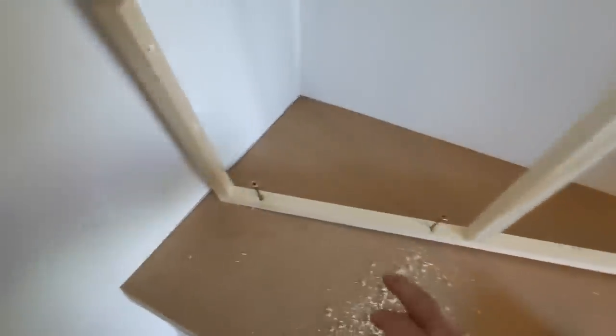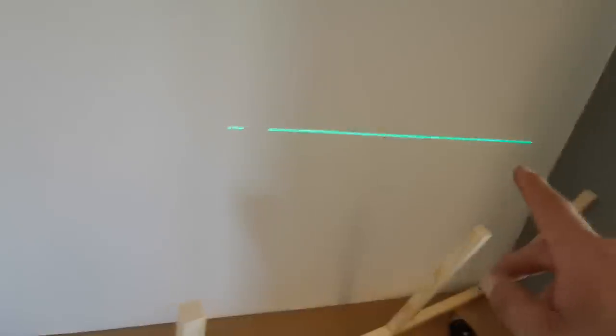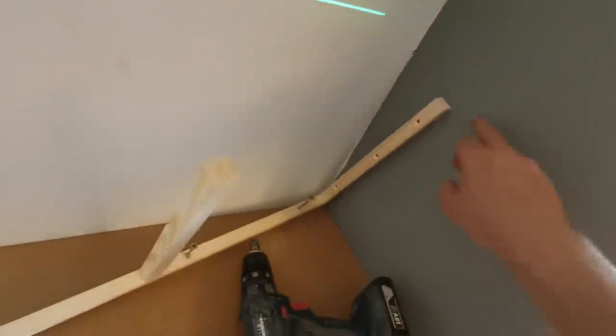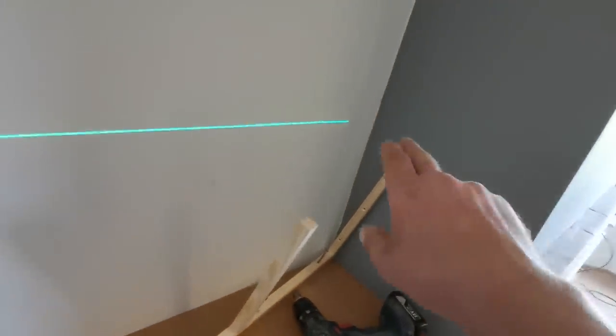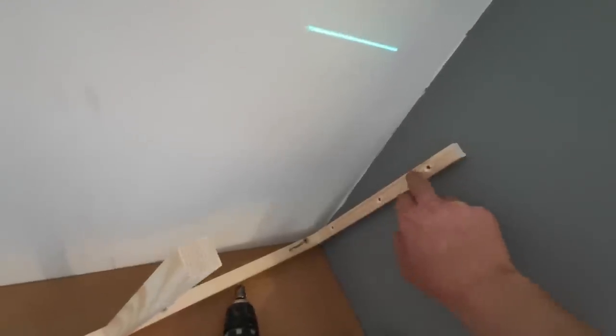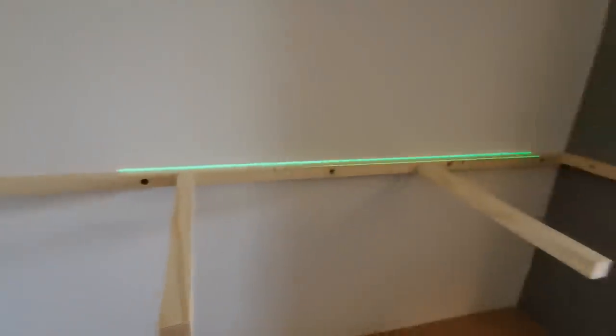So I've drilled it just like I did at the pattern below. I'll hold it up to my level line, hit these screws, mark the wall, drill it and put three in this side, in each side. Sod's Law says some of those won't be good, but because they're inside the box, I can just re-drill them. So, like that.